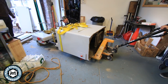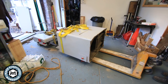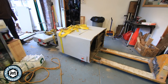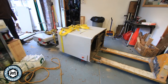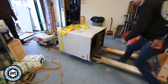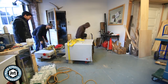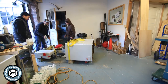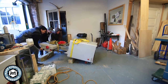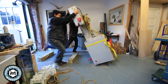This whole method of using the six by six with the pallet jack works great. Having six by sixes when moving anything is great for blocking — they're really strong and they're high enough that pretty much any pallet jack will get under them no problem. It's on two blocks now, so it should just teeter back almost immediately.